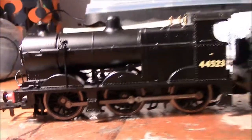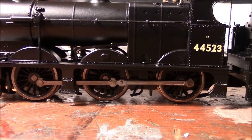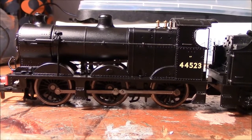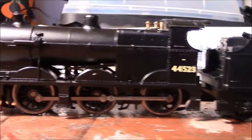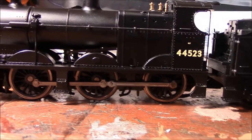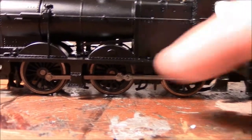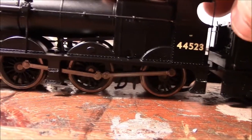And also the other reason as well, when I actually put the other crank pins in, I tried to quarter the wheels roughly as best as possible, and they were going around quite smoothly, and they were set in the right direction and the right settings. And when you quarter wheels on a loco, that term means you align the holes for the crank pins and the actual driving mechanism, i.e. the crank rods. You've got to line them up so in a way they all line up. So when you turn the wheels and there's a revolution of the wheels, the whole thing goes round straight.